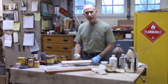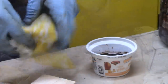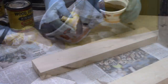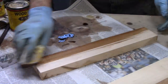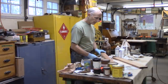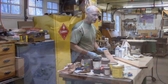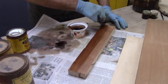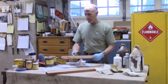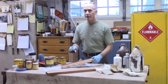Maple is a good example to demonstrate dye stain on. It's the kind of wood that doesn't really take oil stains very well — it's just too hard — and it's also very uneven with oil stain. With a dye stain it can be done evenly. This is a perfect brown stain; I've thinned it out two to one with thinner. That stained it a nice light brown. One big advantage of dye stains is I can apply more of the same stain to make it darker — I could keep going and make it as dark as I wanted. Maple is one of those woods where if you want to stain it to look like mahogany or walnut, you have to use dye stains.